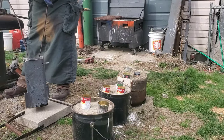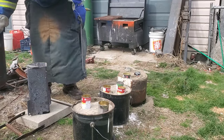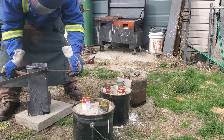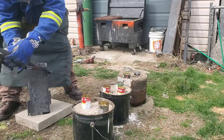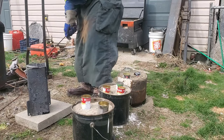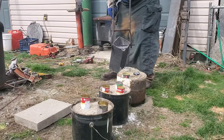A really important side note is all of the PPE that I'm wearing. Not all my PPE is perfect but it's a great start — better to have something than nothing. One key piece of PPE that's often overlooked is an organic filter mask, because this is going to kick off a lot of gases, not only during the pouring phase but also in the knockout demoulding phase.